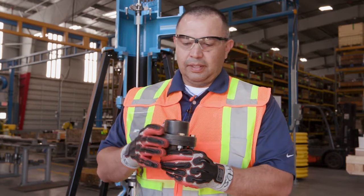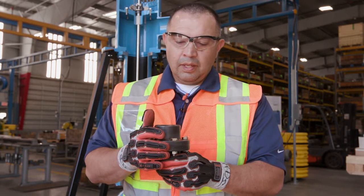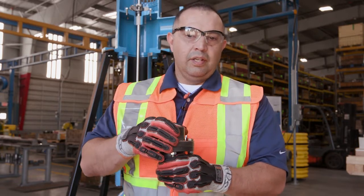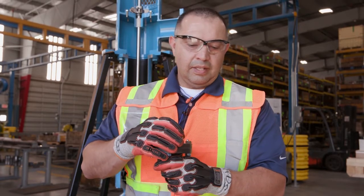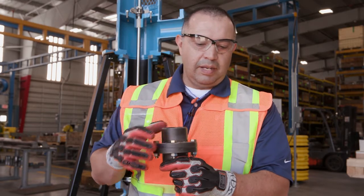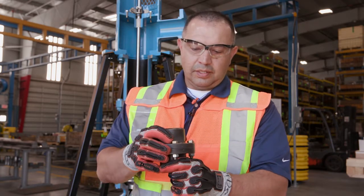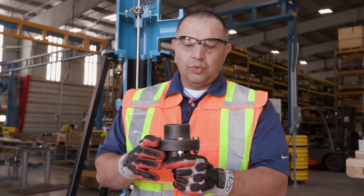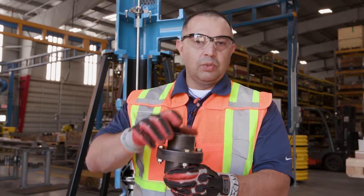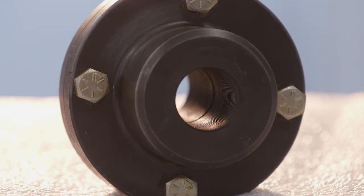The reason we use this coupling instead of the threaded coupling is that the shafts do butt, but on 350 horsepower or greater, when it starts, the motor transmits the torque to the shaft and you won't be able to get the shafts apart just by using a standard threaded coupling. So with this one, you have four bolts on the hub pattern — even if the shafts torque super tight, you can always get this coupling apart just by taking the four bolts off. This coupling can also be used with our cast iron or fabricated steel discharge heads.